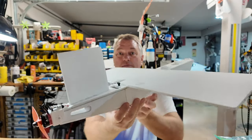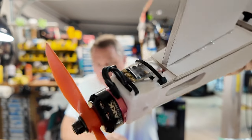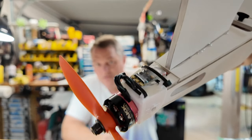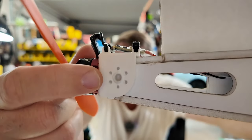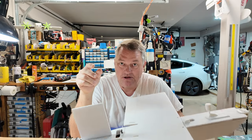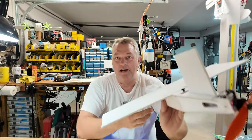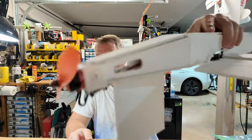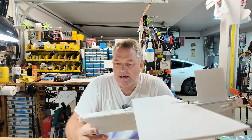If you're going to build one, you're going to need a 3D printer because you'll need to make parts like the motor mount. That motor mount keeps your ESC outside and in the wind so you don't have any overheating. Check this out — there's a little star pattern; you stick the tip of a hot glue gun inside, and channels are cut underneath in the shape of a little asterisk. The hot glue runs down those channels and pops out through tiny holes, giving you really good adhesion on both sides.